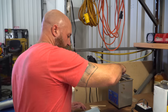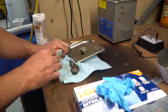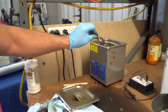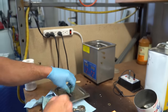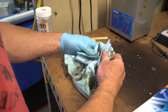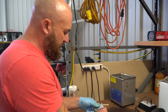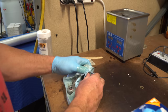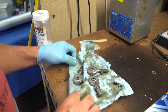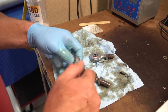These parts have been in the ultrasonic cleaner for a little over half an hour. Oh, they're really hot — that's why we have gloves. The cool thing about the ultrasonic cleaner is we use Hoppe's No. 9, which is a gun cleaner that gets inside pretty much anything you soak in there. It lubricates as well as cleans. Now they're perfectly loose.